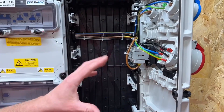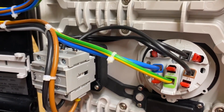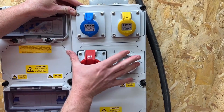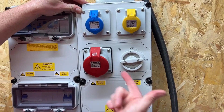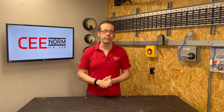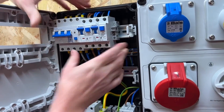In the video, it can be seen that the VariaBox has a 110V and 400V supply from two different circuits. This could quite feasibly lead to danger when opening up the VariaBox for testing or maintenance purposes if suitable precautions are not taken. In this video, we will address the common misunderstandings around whether this practice is actually permitted by BS7671, what the dangers are, and attempt to answer the question about what BS7671 deems as suitable precautions when multiple circuits are installed within a single accessory.